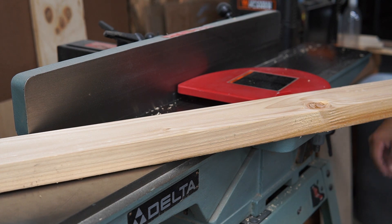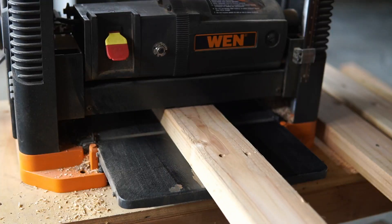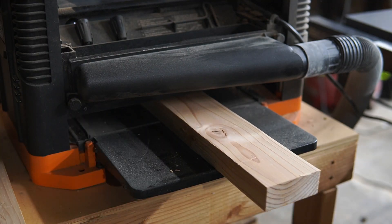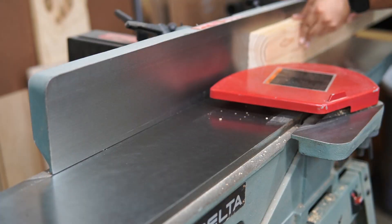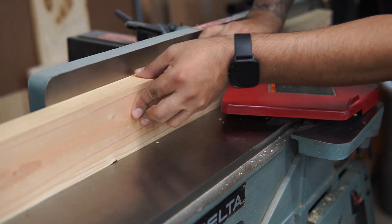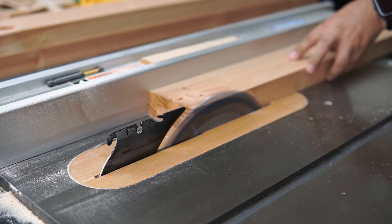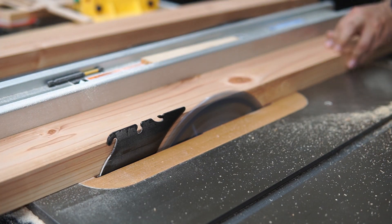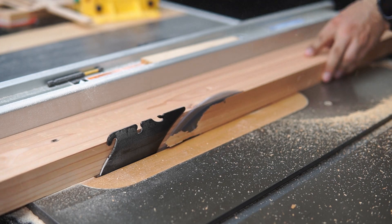Once I've made a couple passes and I'm sure that the bottom is nice and straight, I take it over to the planer and make the opposite side nice and flat as well. Now I realize not a lot of people have a jointer and a planer, but you can go to Lowe's or Home Depot, sift through the piles of lumber, find the straightest 2x4s you can, and at the table saw cut out the rounded edges — that way you have nice flat surfaces to glue. Once I had three flat and squared edges, I took it to the table saw and cut the final side.